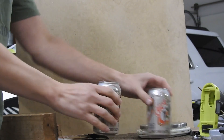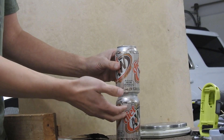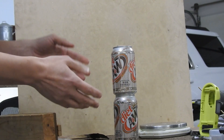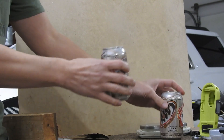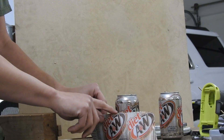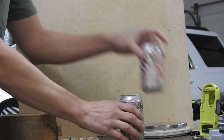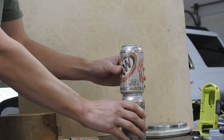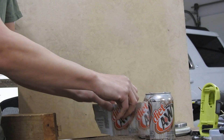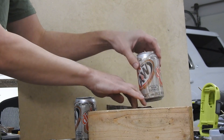So how does this explain the 2.5 seconds of freefall in the World Trade Center 7 building? If the top portion of the building is falling down, you'd think the bottom portion would offer some resistance, because it's strong enough to support the upper part of the building — so you'd think it would slow it down. However, as we've just seen, if you remove the structural support of the lower part of the building and just have the steel of the exterior wall, it can only support about less than half of 1% of its actual weight. So what we're seeing in the WTC 7 collapse is not one part of the building falling on intact, strong other parts — it's the upper part falling on a part of the building that has been structurally compromised. And you can't see that part of the building because it's behind other buildings in front of the videos being shot.